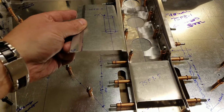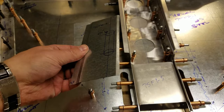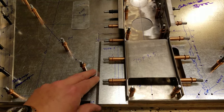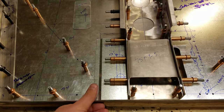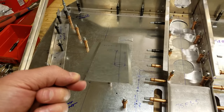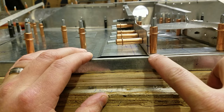You can see the slight joggle that this requires — I'm having a hard time focusing on it with the cell phone. This piece fits right up against the center gear channel on the firewall and then gets riveted along the flange. So you have to put two joggles in this piece. One just abruptly ends at the end of the joggle, and then the other one has a riveting flange on it so that it tucks properly up against the center gear channel.